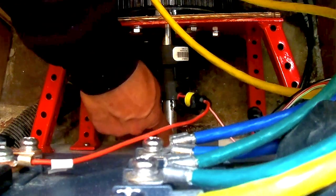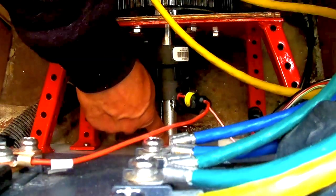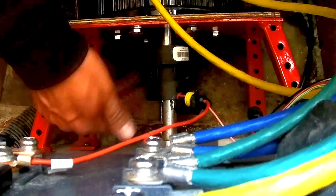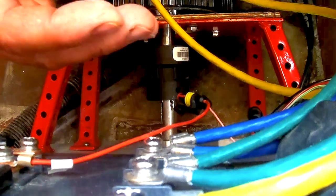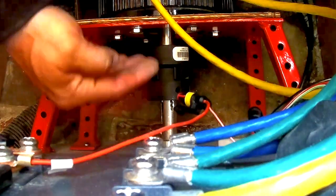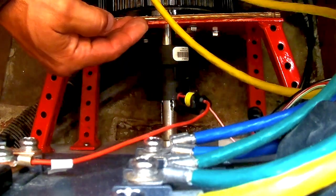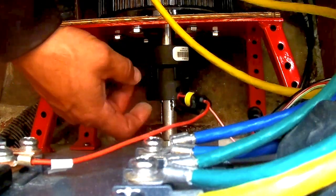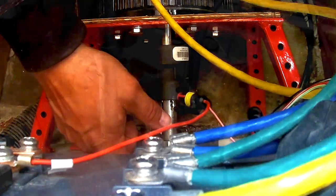There are two couplers on each side — last year I only had one, but I wanted to double it up. So there are two shaft couplers locked on the shaft. When you have the propeller pushing the boat forward, the two behind can't push past the bearing. The bearing is affixed to the steel plate here.